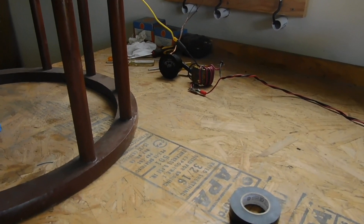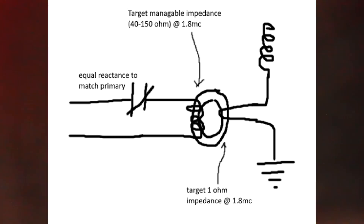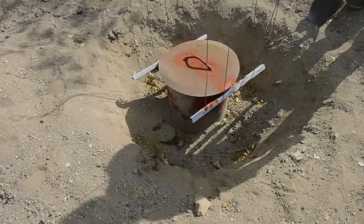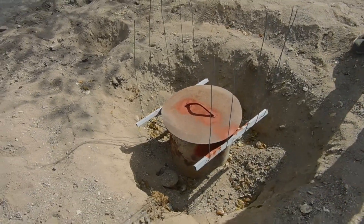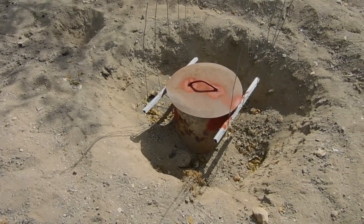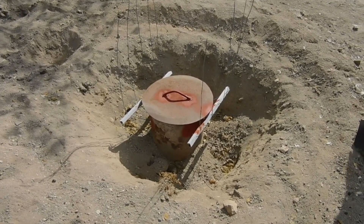One of the factors we think is going to have the largest impact is to take this entire setup and move it outside. By moving the system outside directly to the tanks, the vertical risers can act as ground points, so the Tesla coil can be connected with much lower resistance and much lower ground impedance, which potentially would get us significantly larger ground currents. We'll see what the next couple of days has to bring — fingers crossed — and maybe we'll get some successful reception at a significant distance.